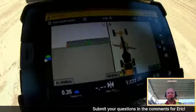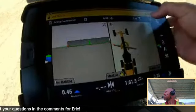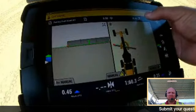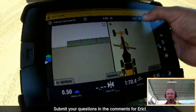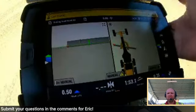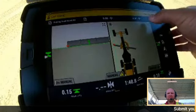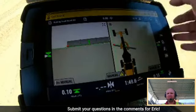Now, one thing I want to do real quick is show a benefit I love about this: there's memories in our offset. So I was up on the slope, and we have our slope overbuilt, which you can see 0.33. We have that overbuilt, and I have that as slope grade. I can push the button on the top again. That's floor grade. Now, if I push it one more time, it shows 0. That's actual design grade. So I'm going to go back to floor grade.